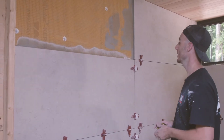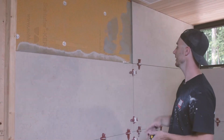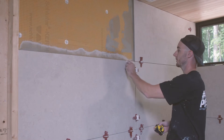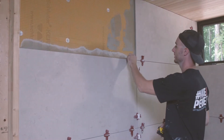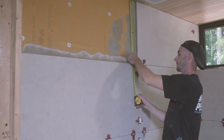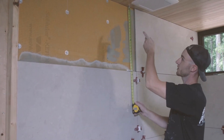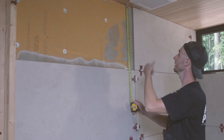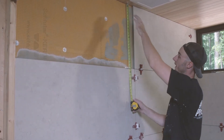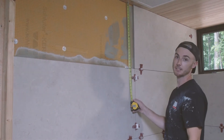We're on to the last row now, so all we have to do is measure the length of the cut. We need both sides, so we got our spacer in here — this is our 2mil, 1/16 spacer. For easy reference you can just pop that in, butt up to the ceiling, and measure to it. Subtract a little bit — in most cases you're going to have silicone either to drywall or tile. In this case we got a wood trim, so I know I have some play to deal with out there. I'm going to leave a little bit off, make some room, make sure I can get that tile in nice and easy.